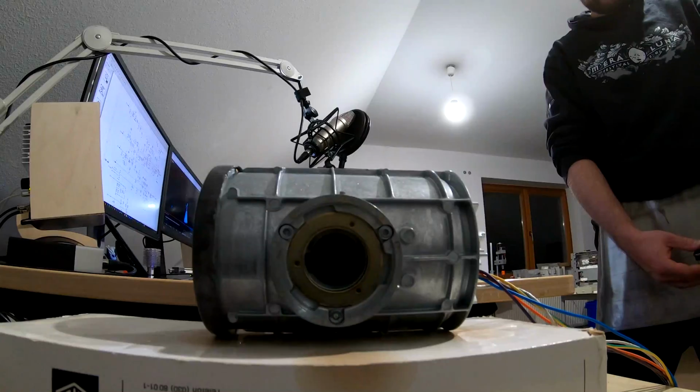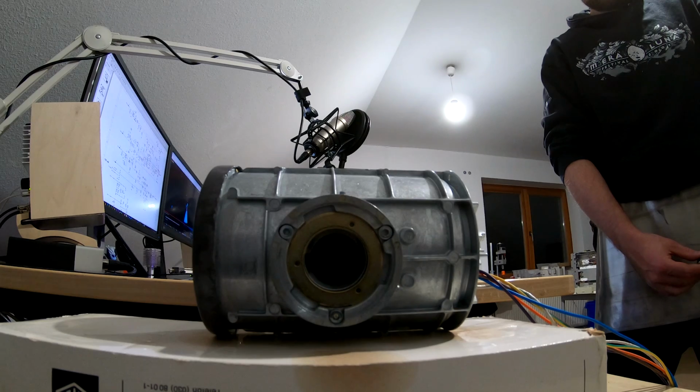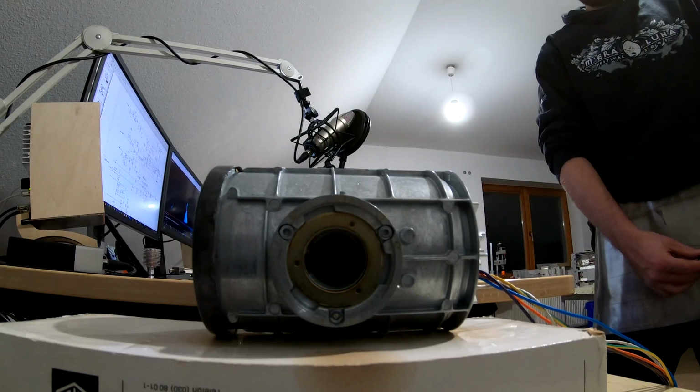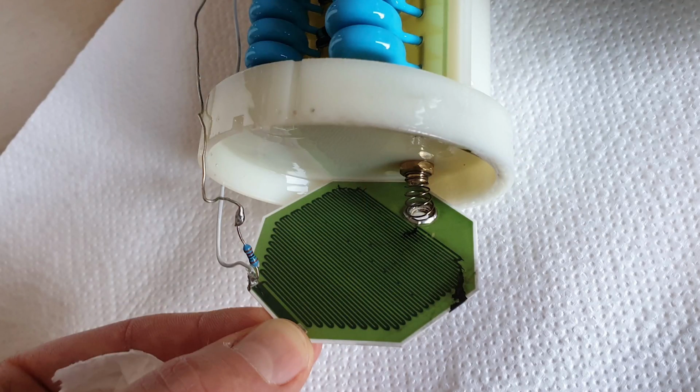That seemed to work, and I was confident enough to announce preliminary success in the previous Patreon daily. But it didn't last long enough to do anything with it. Soon, pulling the trigger made the head unit sound and actually shake like a boiling kettle. Internal arcing yet again. I assume the 3D printed plastic has a high dielectric constant. Next, I tried replicating the plastic cup by pouring in silicone rubber, which resulted in another catastrophic failure and destruction of the remaining half of the high voltage resistor network.